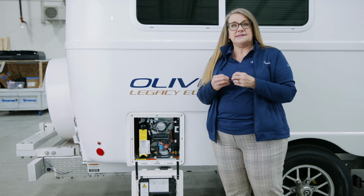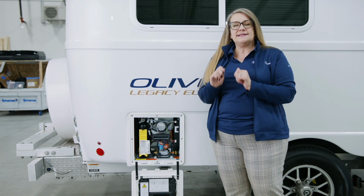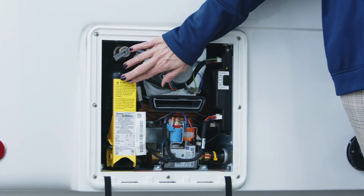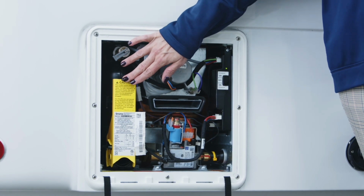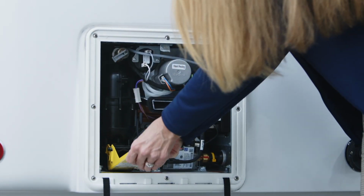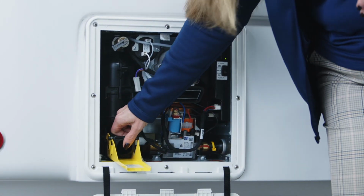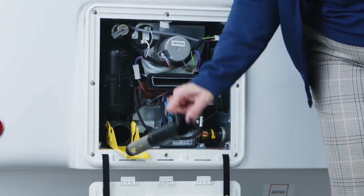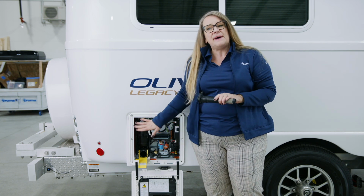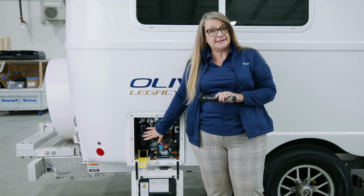Once the system is depressurized, what you'll do is take your thumbs and lift up on the latch right here on the AquaGo at the Easy Drain lever, and you'll lift that up. You will drop that lever all the way down, and then you're going to remove this filter cartridge. Once this filter cartridge is removed, it's impossible for the AquaGo to hold water inside.